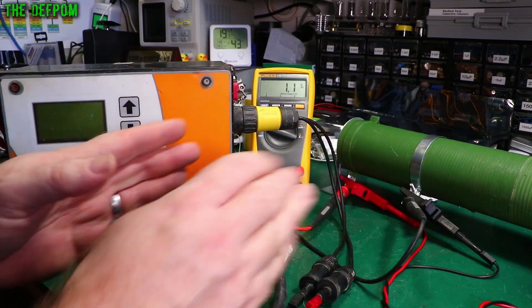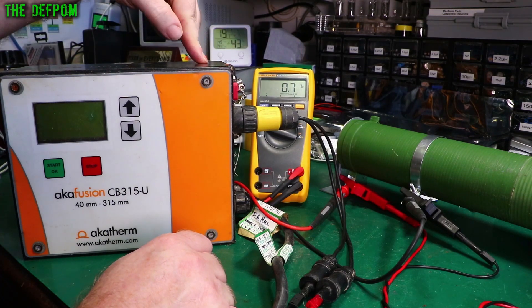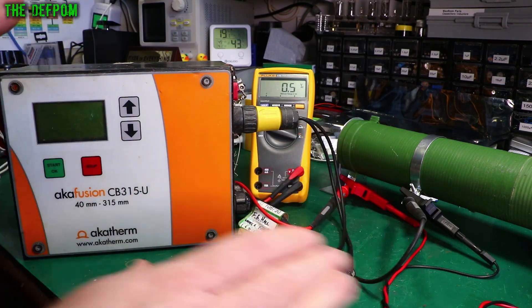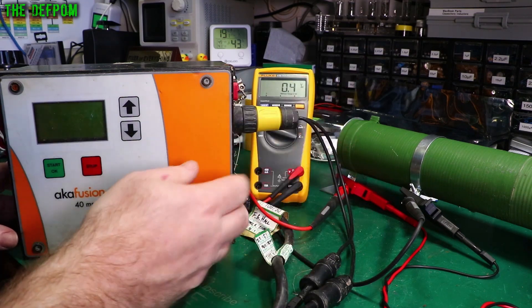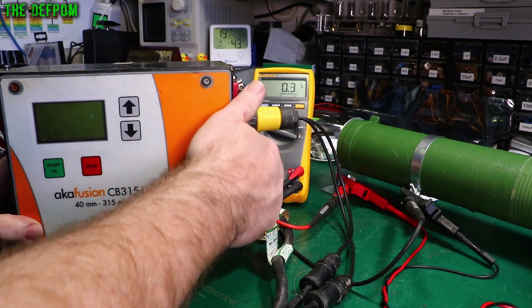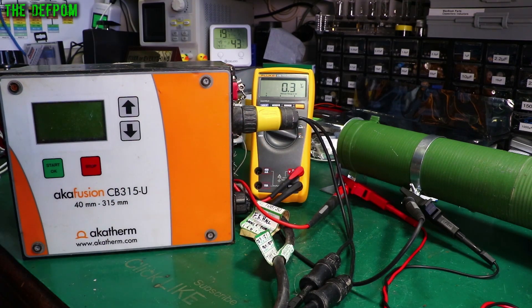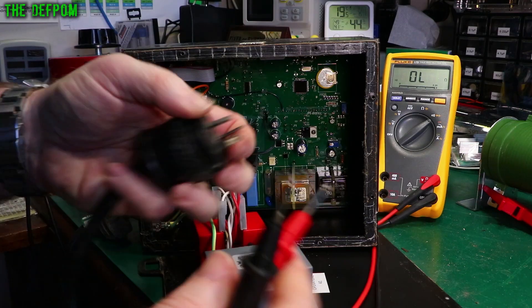Let's try this for the first time. I've got it hooked up to my test rig with a 20-ohm resistance and a multimeter measuring AC volts, because this should output about 100 volts AC to generate 500 watts. Everything's hooked up, outputs going to the resistor, meter probes in position. Power switch is on... no power. It's dead.